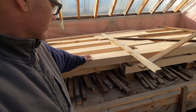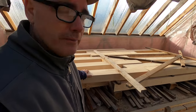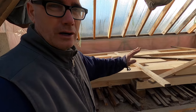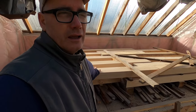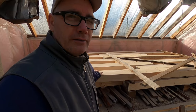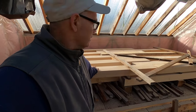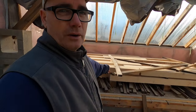This stuff is I think like 14% or so, but I didn't measure way over there because the stack of boards was on top. Anyways, it's not completely dry, but it's dry enough that I can put it back on the sawmill and resaw them. Some of them have a little bow to them. They're not all the same thickness, so the plan is to get them sawn down to like 3 1/8 by 5 1/8, because I'm going to take them down to the shop and plane them down to exactly 3 by 5s, and then do all the tenons on each end, so they're basically ready to go. So that's the plan, is to empty the kiln and put all the stuff in the sawmill and resaw it.